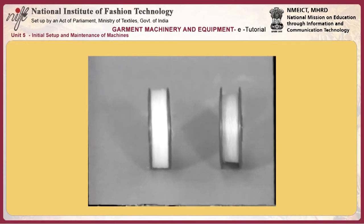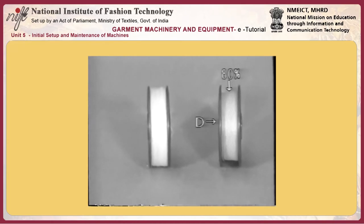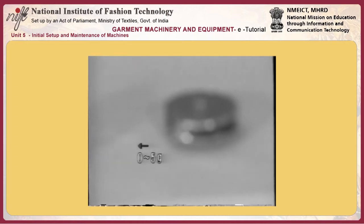15.7. Adjusting the sewing with synthetic thread. When synthetic thread is used for sewing, in particular, thread slip-off and thread breakage can frequently arise. To avoid such troubles, the following adjustments are necessary when using synthetic thread or sewing synthetic fabric or mixed fabric. To prevent thread breakage or stitch skipping due to the hot needle, or rupture or welding of thread and fabric resulting from the needle heated by penetration resistance of the fabric, the following measures have to be taken.